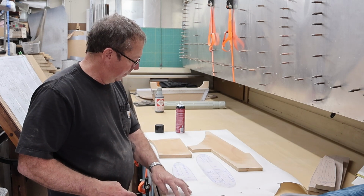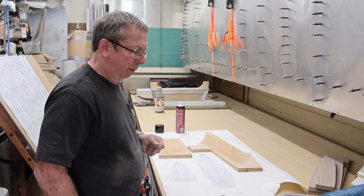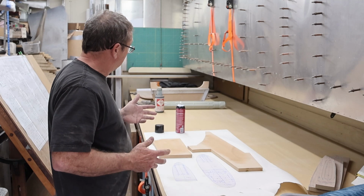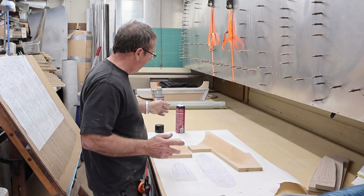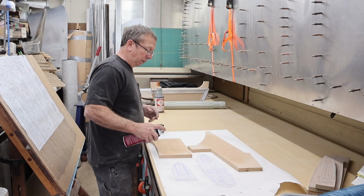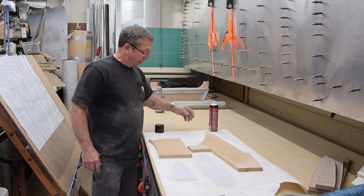Note, and of course we know I always have to have something to complain about. But once we start forming metal, once we get ready to start riveting stuff together, it's going to get etched and anodized, or aluminum prepped. It's usually a phosphate etch type of thing. Anyway, historically, I was brought up in the paint industry using AlumaPrep 33 and Allodyne 1201. I think 1200 is the clear, but 1201 is the amber-colored Allodyne.